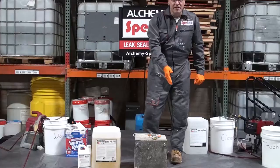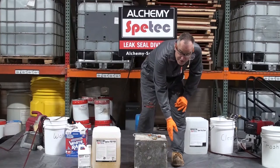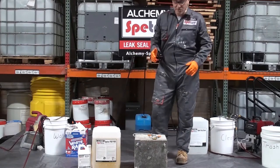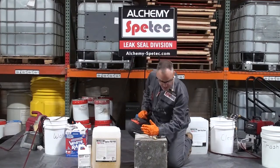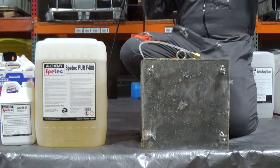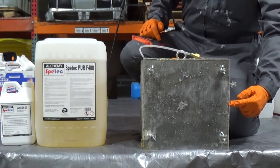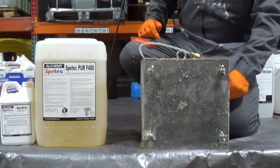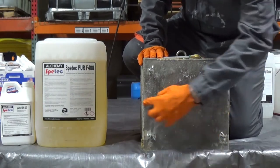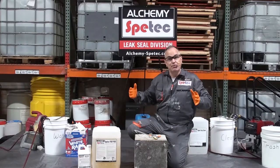For typical crack injection, if your wall is one foot thick — in this case ours is one foot thick — you drill off your defect half the distance, which is six inches, and drill at a 45-degree angle. This forms an isosceles right triangle, and you can see we've intersected our crack or defect right in the center. Liquids are lazy — they take the path of least resistance. Coming in this way from the center, the grout has to travel out and usually reaches the back side just as it reaches the front, giving us a full depth repair.